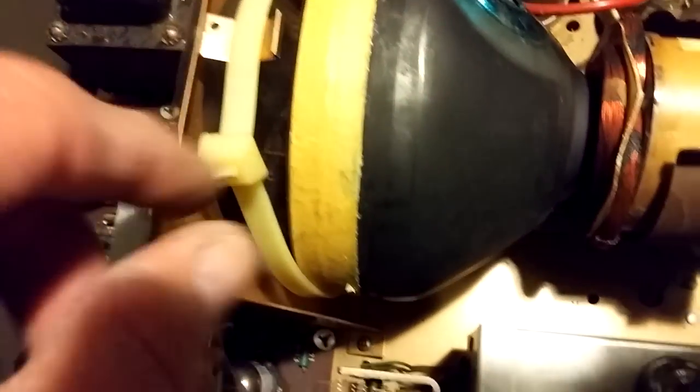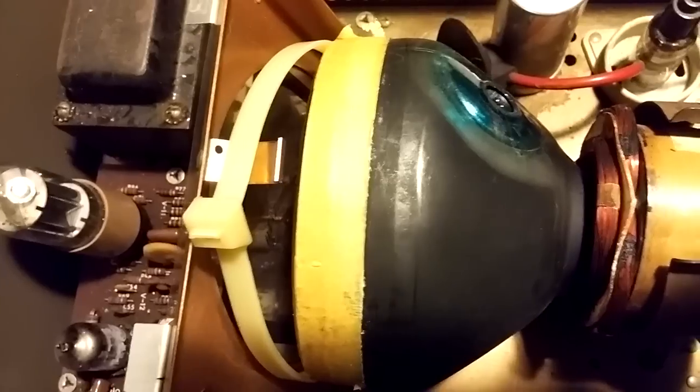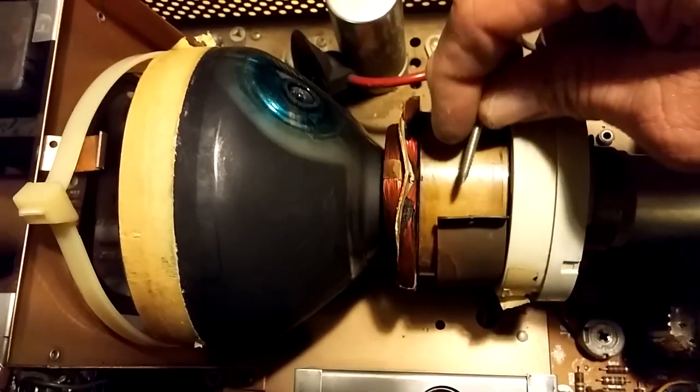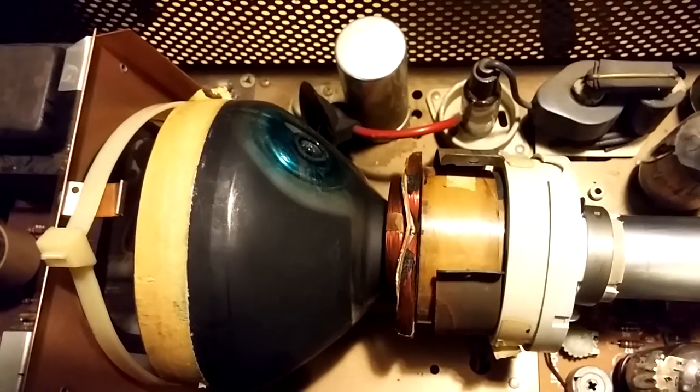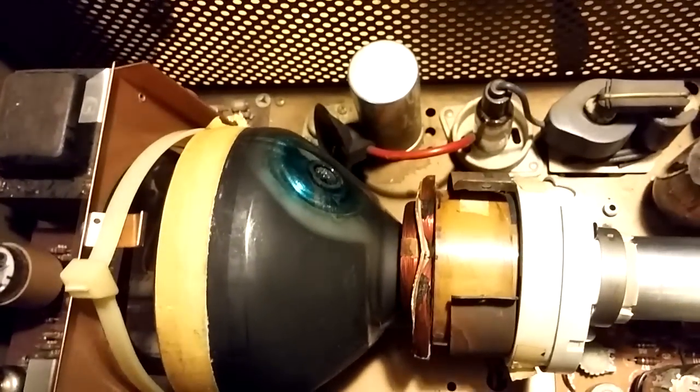To document this: to get the original CRT out, there's a screw on each side of this mounting bracket here, and I've just loosened them up quite a bit so I could slide this forward enough to get the zip tie off of it, get the anode off, and discharged the screw that holds the yoke in place — that bracket and the spring that goes from the cover to that screw.